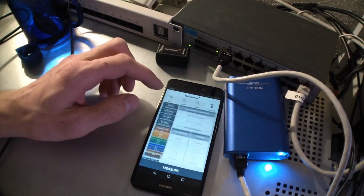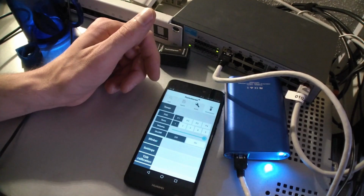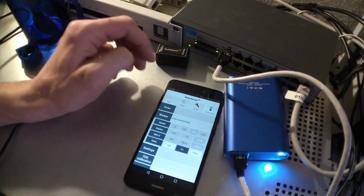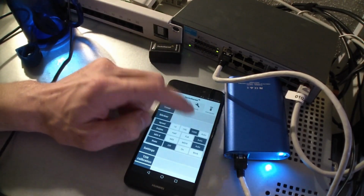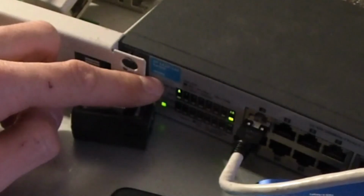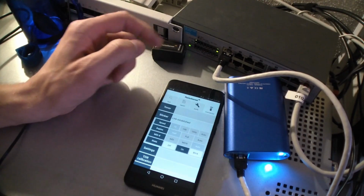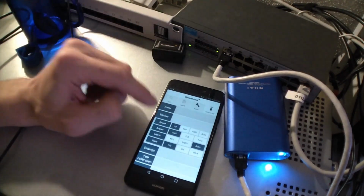Whatever. Yeah, so, and yeah, tools. You can tone through the network, but I shouldn't do that with this thing yet, because I could ruin my switch. A blinker, yeah. Link established. So you could actually say, hey, I want to connect at 1000 or at 100. Then that one should be blinking only. Right? Or off at the 10, half duplex. It doesn't show at 10 megabits half duplex, but it can actually establish a link on anything you want. So this is really nice.